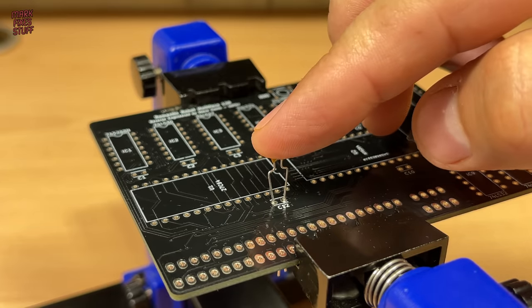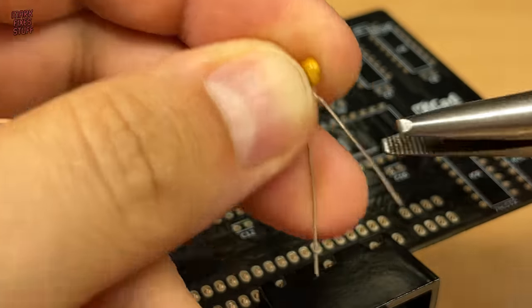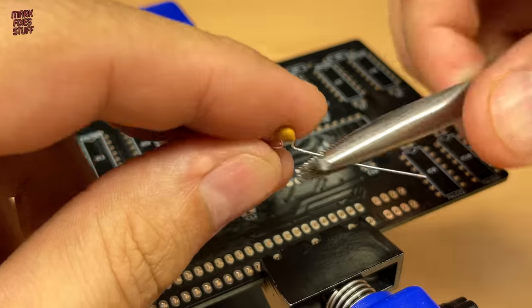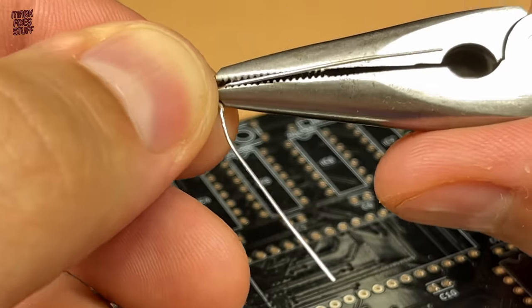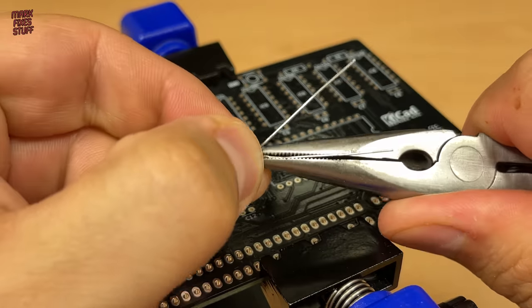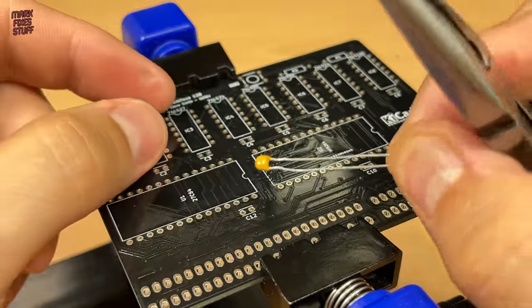These don't fit. The pitch of the leads going into the component are correct, but the mounting leads are widened. This was a mistake on my part when I checked what I had in the parts bin. So to save reordering, I'm simply straightening the legs. Not really good practice, but it will save us time waiting around for a delivery.